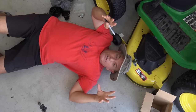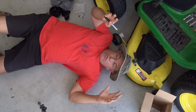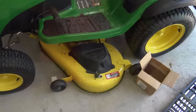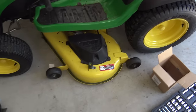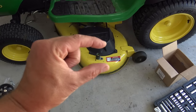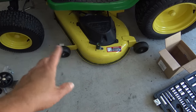I'm going to answer a couple questions about the height of scalp wheels when you're riding, but I don't know why manufacturers don't put more scalp wheels on decks. So I'm going to add one to my John Deere. One of the reasons why I bought this John Deere — I went to a 48-inch deck — is because it had the four scalp wheels. Scalp wheels are an absolute must when you're trying to cut Bermuda grass at an inch. So one, two, three, four on the front and back.